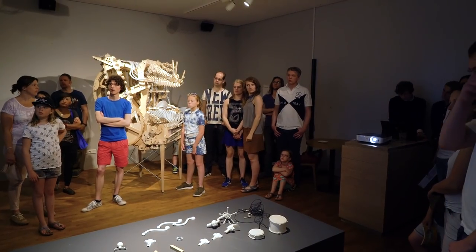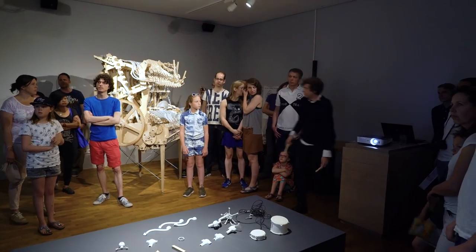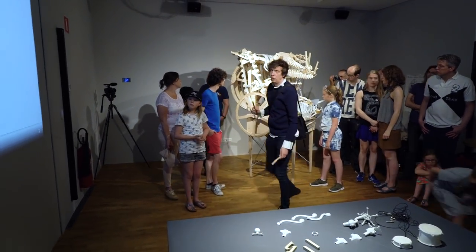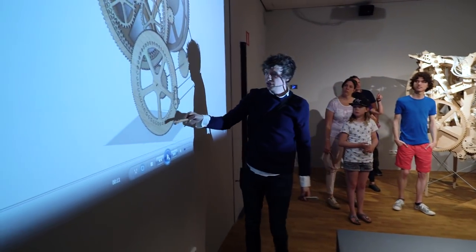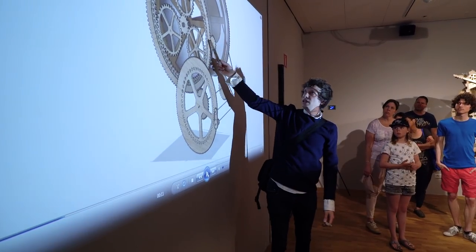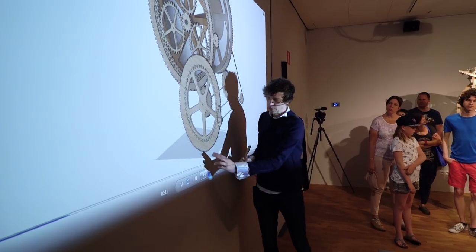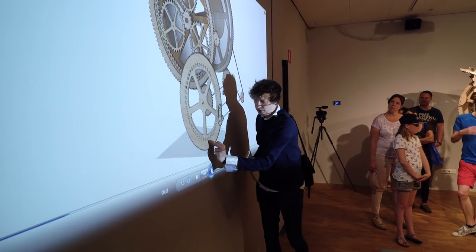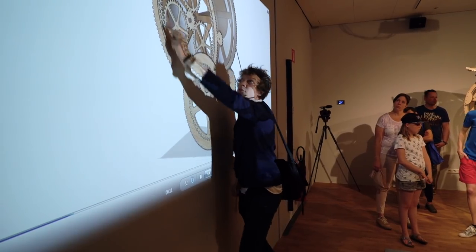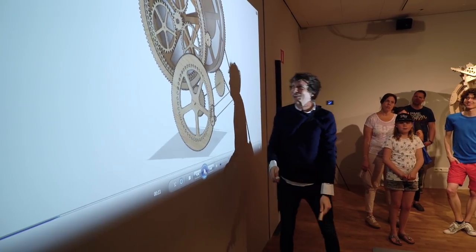Another big difference is the gear train, and also how we're gonna lift the marbles. On this machine, we're lifting the marbles with this belt. On the Marble Machine X, we're gonna lift the marbles inside the gears. So we're gonna use the gears that we already need for the mechanism. So the marbles are gonna go in here and be transported half and go out here, and then go out here and be transported in this inside ring. That's clever. Thank you, we think so too.